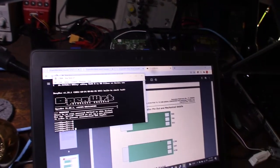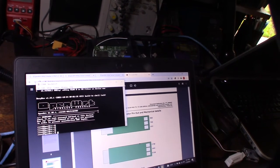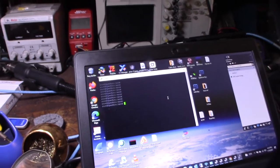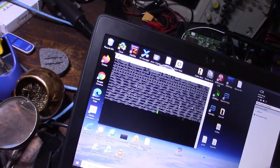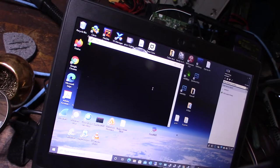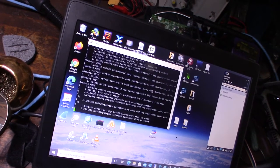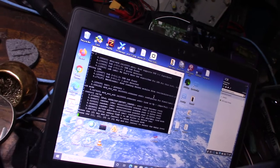This one's definitely cleaner. I'd like to get a completely clean boot — like with a Cisco router where it's usually a bunch of dots. Let me try PuTTY instead of TeraTerm to see if it makes a difference. Maybe it's a character set issue — it's using UTF-8. Let's do a fresh reboot in PuTTY. Same thing — so it's not the terminal program causing the garbling.